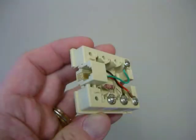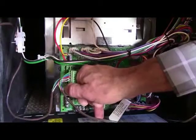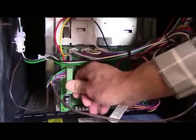When installing the Wi-Fi module into an Econet enabled heating or cooling system, you will use the wiring terminal that is included with the module to connect the module to the system. You will then run wires from the terminal to the communication plug on the control board. This is the same plug where the Econet control center from inside the home is wired to.